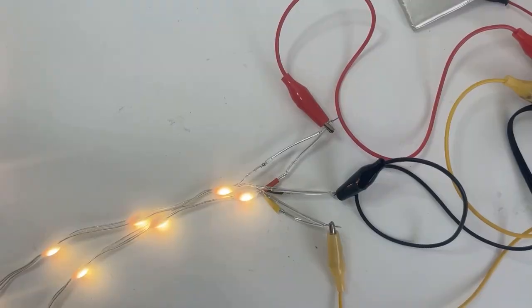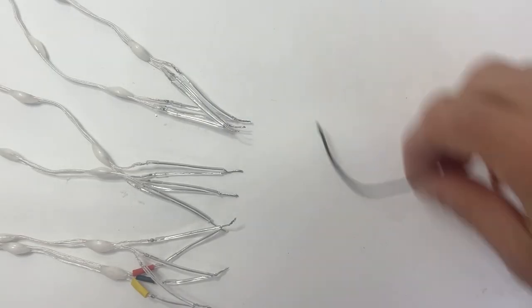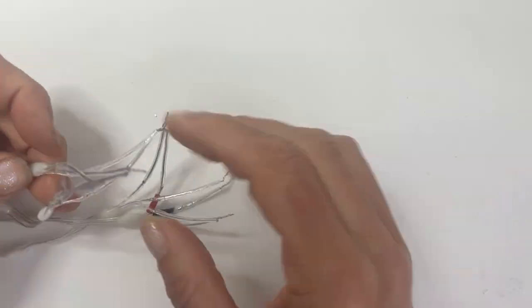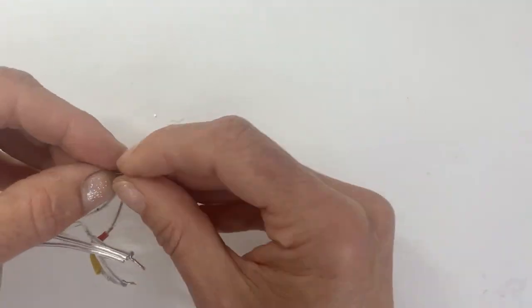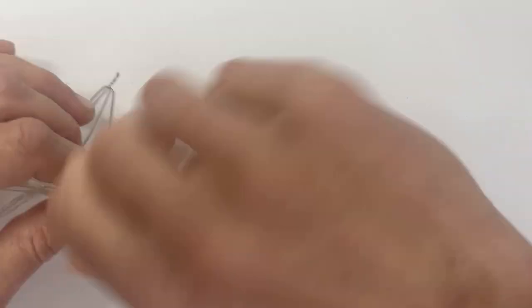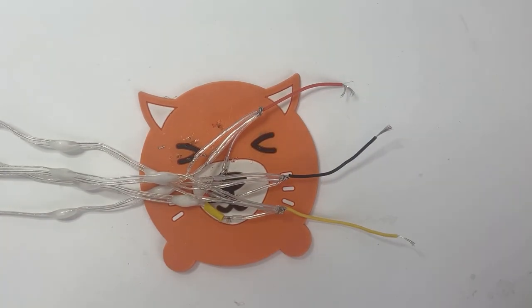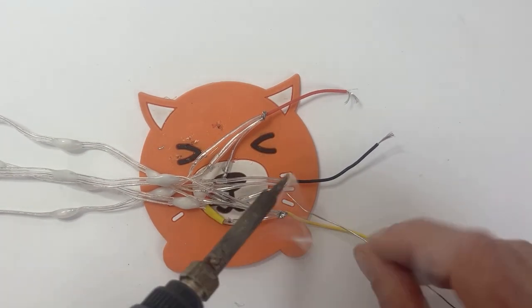Load up the test code from the tutorial on your Circuit Playground Express. On my strands the ground pin is in the middle, power is on the left — if you look close it's a reddish wire inside the silicone coating — and the data wire is on the right. First we need to find the in end of the strip; for me this was the end with the female connectors. Cut off the female connector, leaving some wire attached so you can use it for another project. Strip about a quarter inch of shielding off of each wire and connect an alligator clip to each one. Power goes to V out, data goes to A1, and ground goes to ground. If the strip lights up you've got it ready. Mark the wires so you remember which is which — this is important, you're going to have a lot of bare wires during this project.